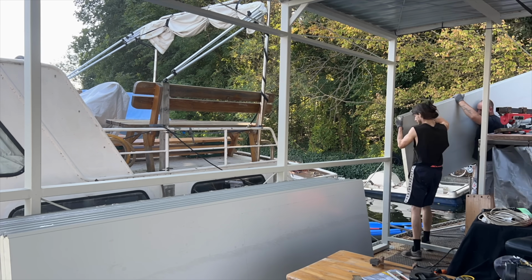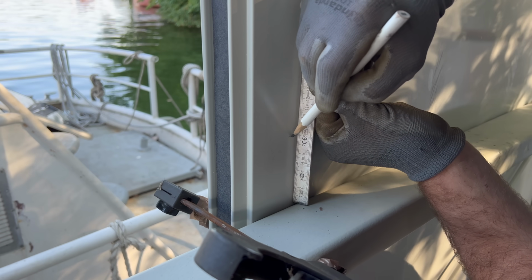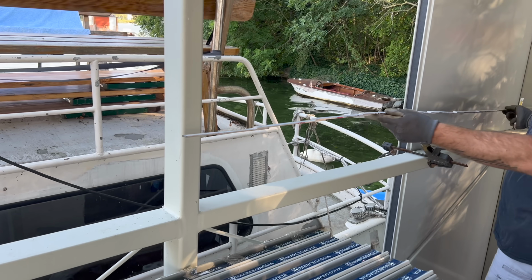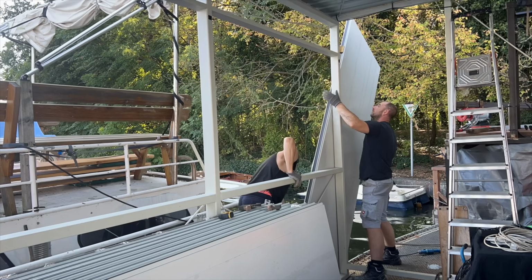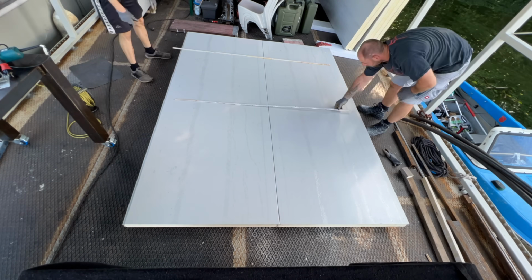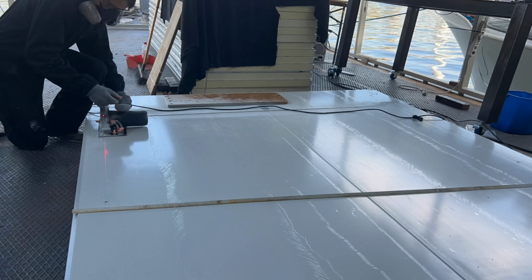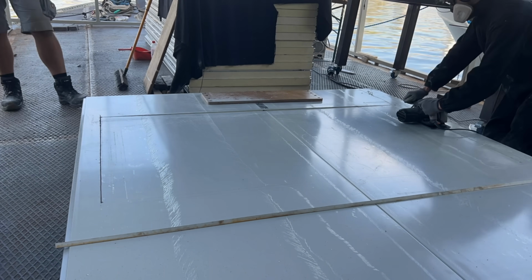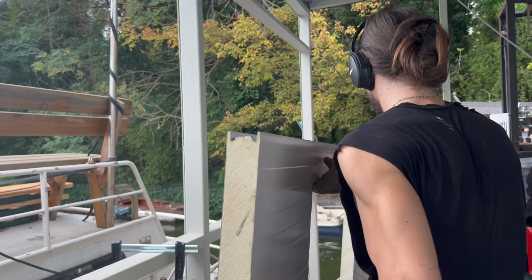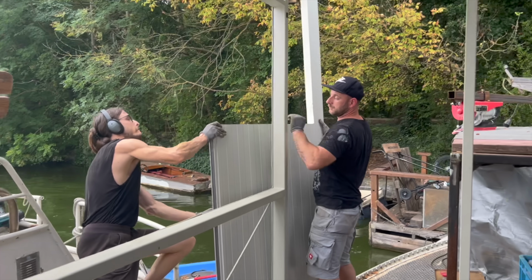The panels we used were pre-cut to the ideal size of 2.70 meters. My original plan was to work on two panels at a time, putting one in place at first without screwing it down, marking locations for doors and windows, taking it out again, putting it on the floor, and now adding a second plate to it, then finalizing the markings on both plates and cutting the spaces using a circular saw with a metal blade. The idea was to secure both plates in place with self-drilling screws after the cutouts were finalized.